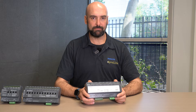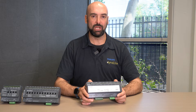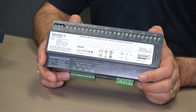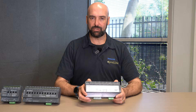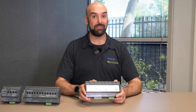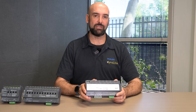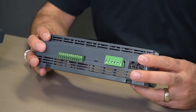There is a special configuration within System Builder that allows us to pair channels together and presents the commissioning engineer with options to drive the blinds through a template. When using the device for blind control with two channels paired together, the device automatically recognizes which is the directional relay and which is the power relay, making sure that the direction is chosen first before driving the power — ensuring that the relays are not exposed to excessive current draw from the motor, which traditionally causes welding. This software fix within the unit allows the device to confidently drive motors without the need for any external protection of the relay channels.